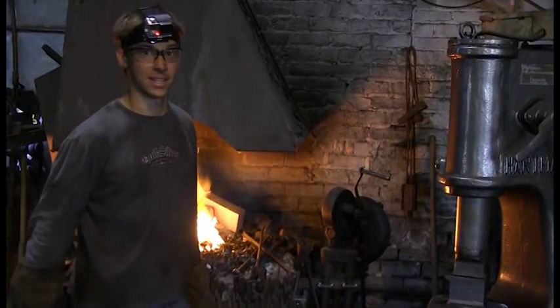What Carter also doesn't understand here is that the flat bar profile we had chosen for this project loses its heat to the anvil almost immediately. There is very little time to hit it while it is really hot. Forging a thin flat bar like this is a trivial task for me. I had no idea how difficult it would be for a beginner.